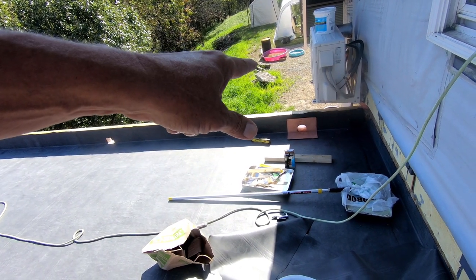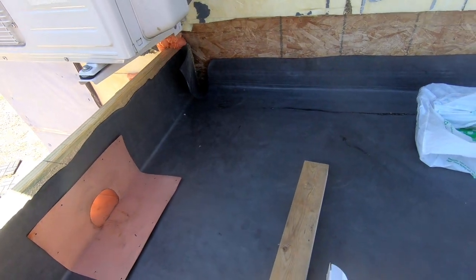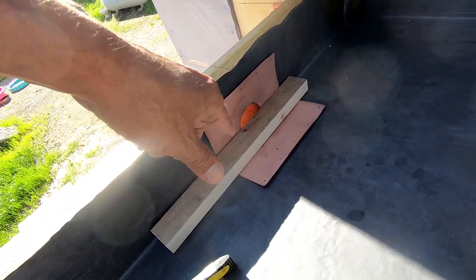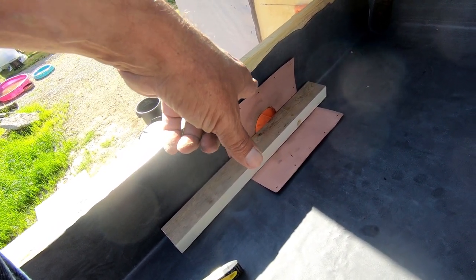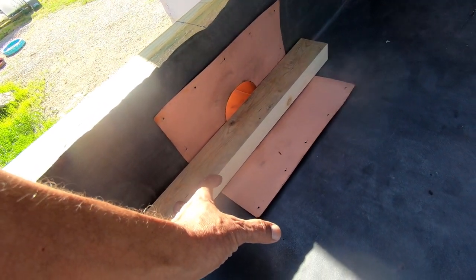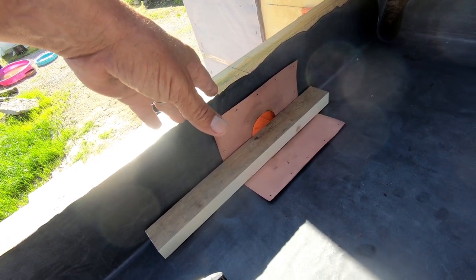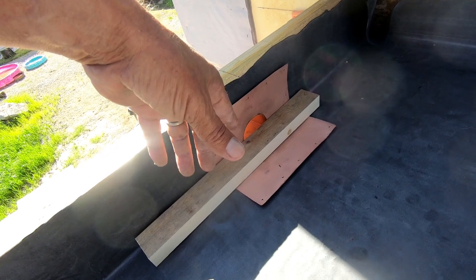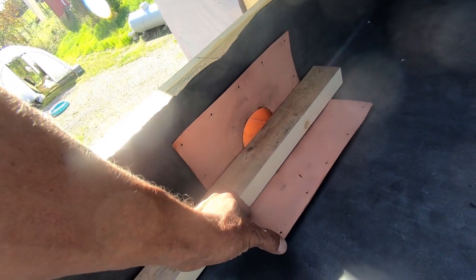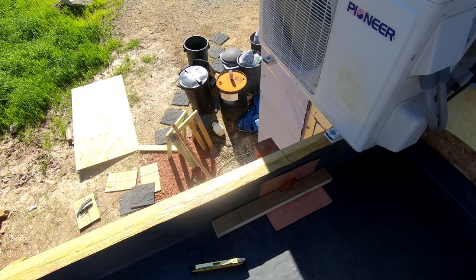I have one of the scuppers drilled, pre-drilled, and popped into place. What I'm going to do is kneel up on that, get it tight into the corner, then nail it down. Then it gets treated as an edge flashing, and I'm going to do roughly what the edge flashing kit says to do — they have it overlapping the metal quite a bit. I think it's a five-inch flashing, and they have it overlapping everything but a half inch. I can go about three to three-and-a-half inches here. If it doesn't work, hopefully it lasts until spring when I can get up here and do something different.